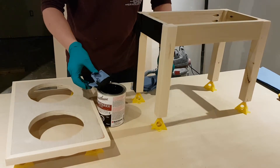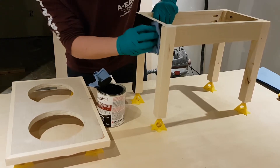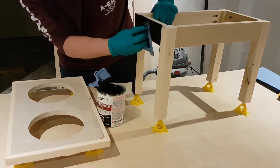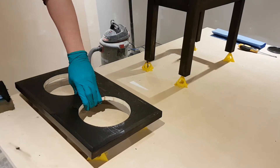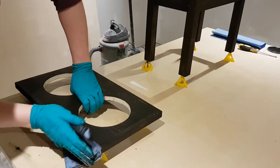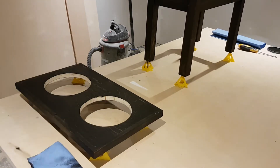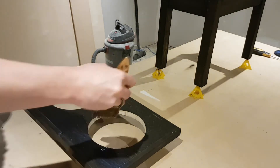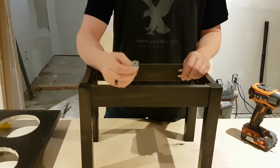After that, just a coat of stain. I'm using an ebony stain — I think the black stain with the stainless steel bowls will look really good. You can stain it whatever color you want. I'm using Varathane Ultimate; I like that it's one coat. Wipe or brush on your stain and then wipe it off with a separate dry towel. With stains you want the grain to show through, so make sure you buff it off. Check your instructions for dry time depending on your stain. From there I'm using a water-based clear — not oil-based — because it's non-yellowing and doesn't warm up the wood.